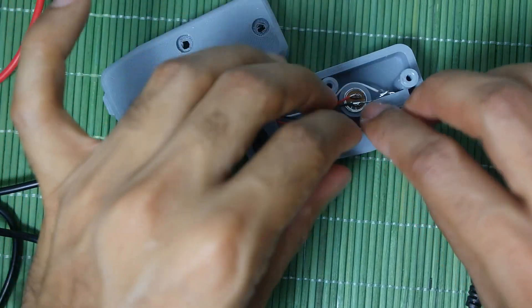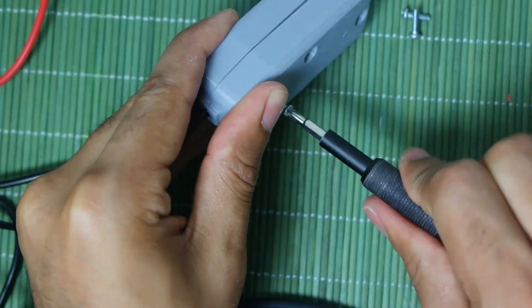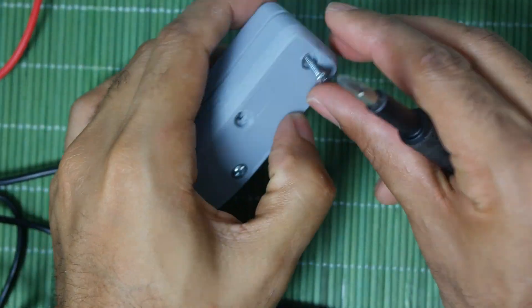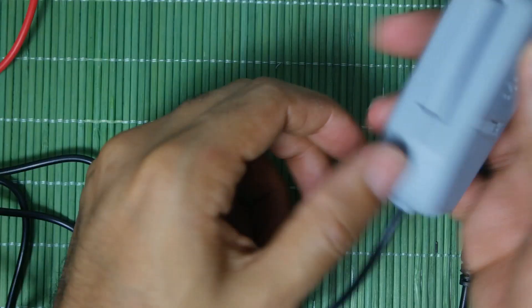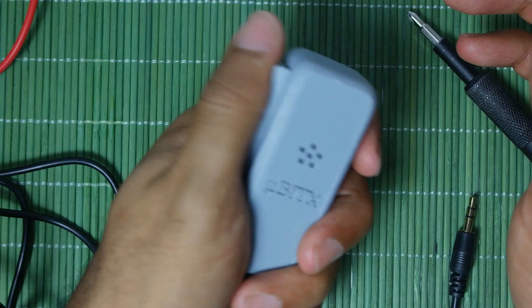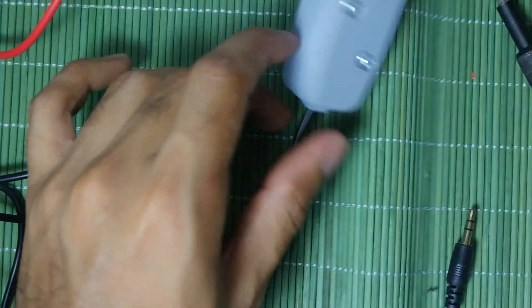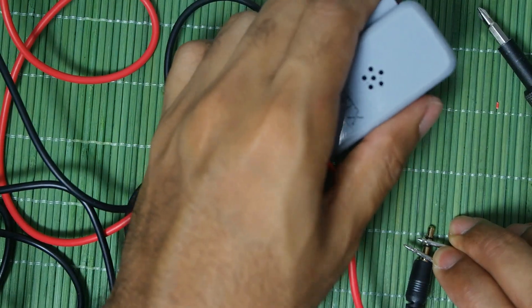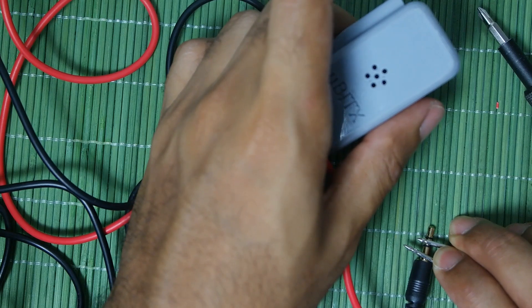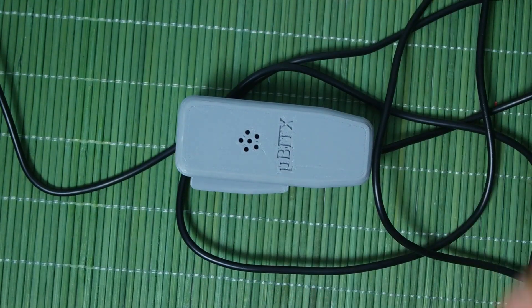Then I'm going to put this here — this is the button. I have my three screws here which go at the back. And now it works fine. I'm going to make sure first that the push to talk button works in the way that is intended. This is supposed to be connected between ground and the second one, and if I press the push to talk — yeah, that should be good. So we have the microphone built. It works fine. PTT works fine, as we tested with the multimeter.